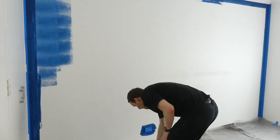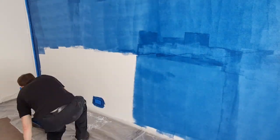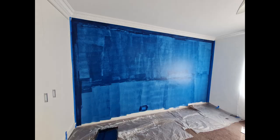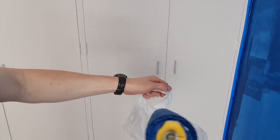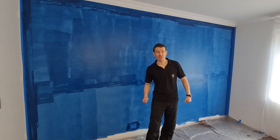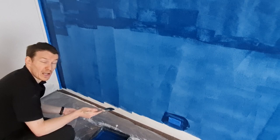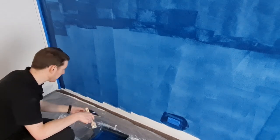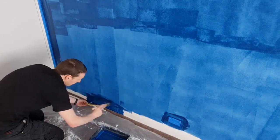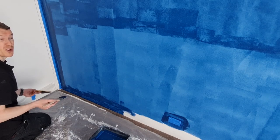Time to load up and slap it on - you don't have to be too careful on this first coat, but the smoother the better. That's most of the first coat on - it looks like a dog's breakfast, my rolling skills are terrible, but trust me and trust the paint, it will come good after two or three coats. The last thing we need to do is get the first coat along the edge of the carpet. On a hardwood floor I could use the shoreline edger, but here I'm going to have to do it with a brush the old-fashioned way. Take the brush out of the plastic bag - a stiff bit of card works well, but these cost absolutely nothing. Jam it right down in the carpet line and that allows you to paint the wall without getting paint on the carpet.